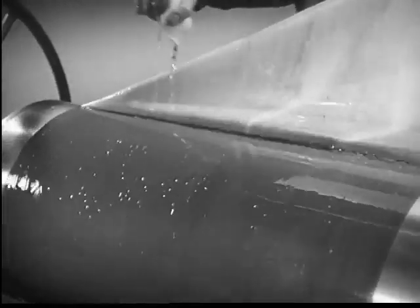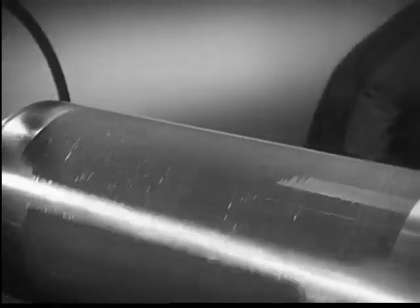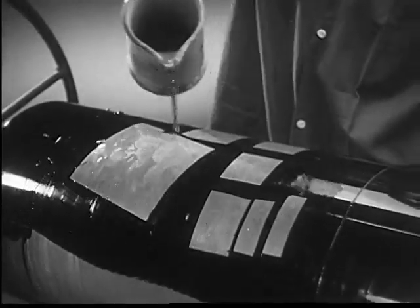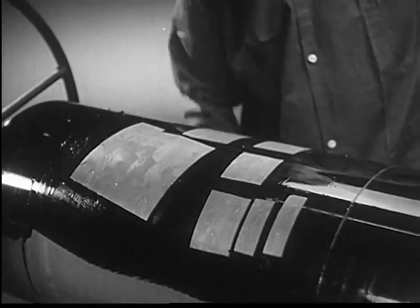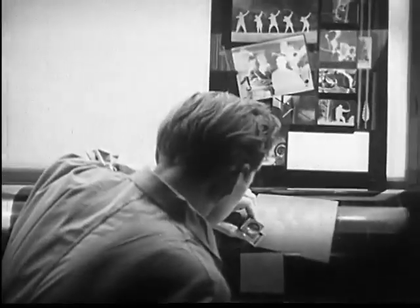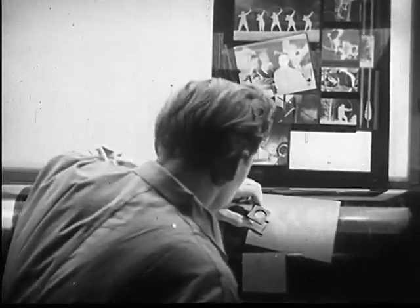The cylinder is now washed in water, and all chemical that was not hardened by light washes off. When the etching fluid is poured over the cylinder, the unprotected parts are eaten away, leaving holes in the copper. Unlike other half-tones, the holes, or low places, in this copper cylinder make our picture.